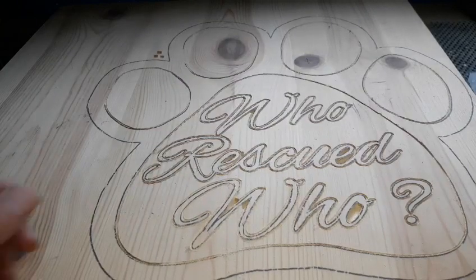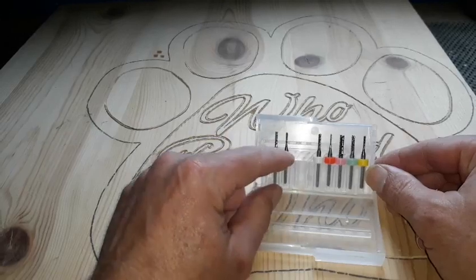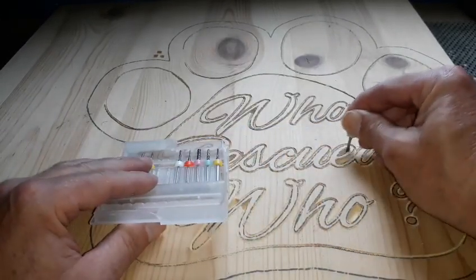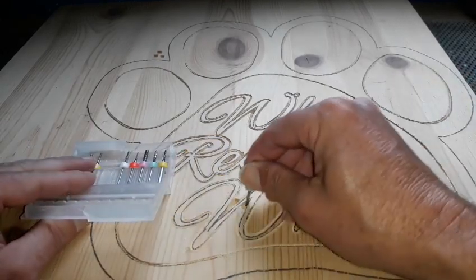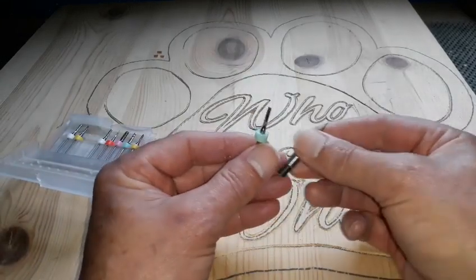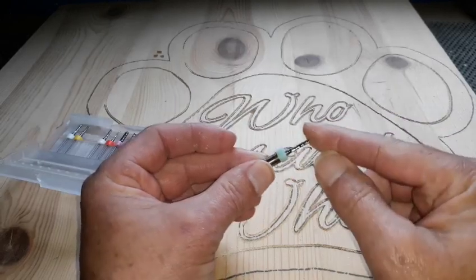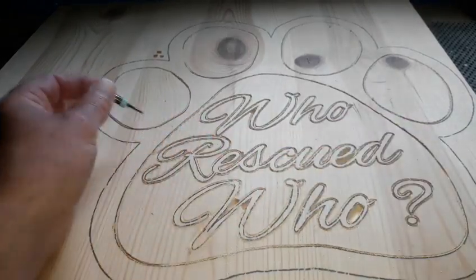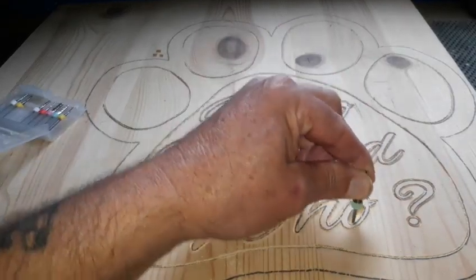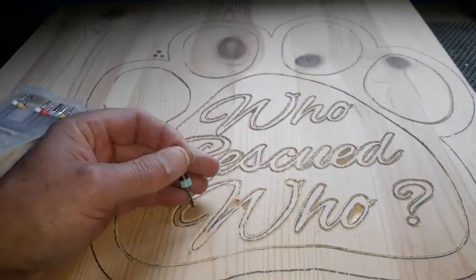So to play safe, as always for me, I'll use my end milling bits. We'll find one that fits into our smallest areas. So we know that fits in there. We'll get it up into there. So we'll go for this green one. And that's a simple case of removing the CNC bit. Like I say, we'll slide that back into there like so, up to that little barrier. Pop that in. We'll set it to one of our depths. You could go inside there if you wanted to, or inside there. Then we know we're at the right depth. And we'll start removing all this backing piece.